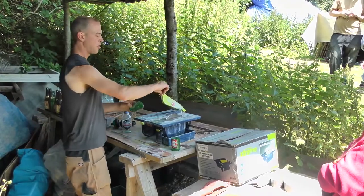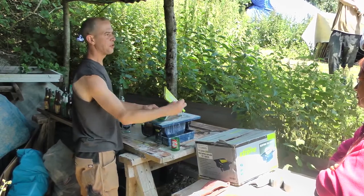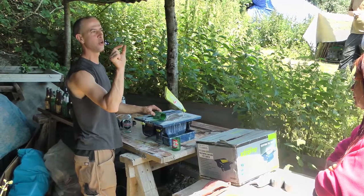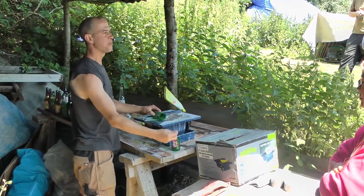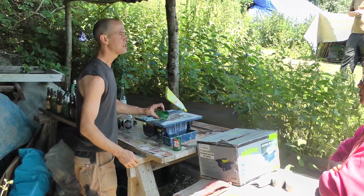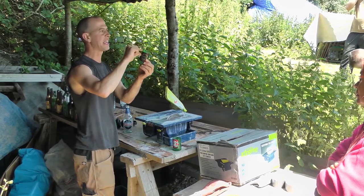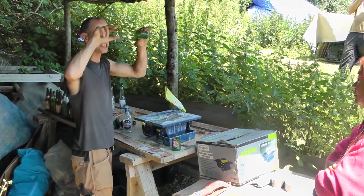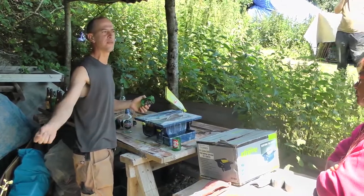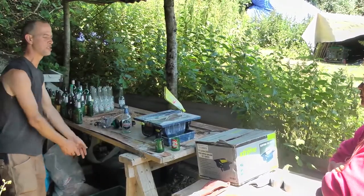another thing, I don't know if you all noticed, but at the last, it seemed to cut through and the top came free because there was just a little tiny bit of glass still holding it together. Now, that kind of breaks off before it actually cuts. So there's a last little sweep into the blade just to cut off what would have been a little burr or tooth sticking up where the last bit of glass was connecting the top to the bottom. So just do that last little sweep even after the top's come free. And there's a recycling bin down here that I just threw the tops in.